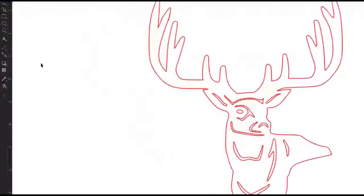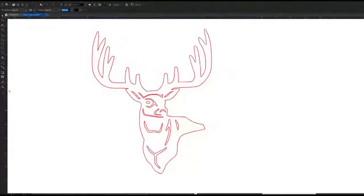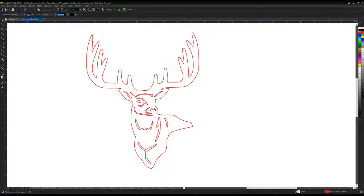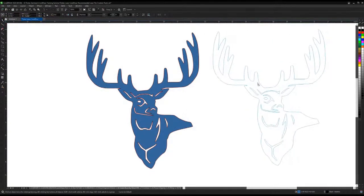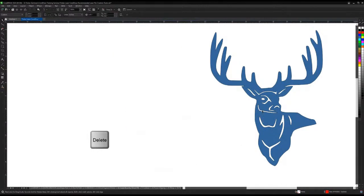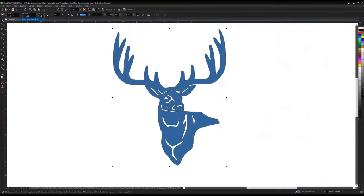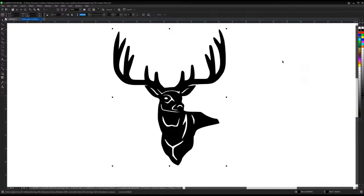Well, the Smart Fill tool with the boundary tool would do the same thing, but you'd have to fill it. Or the Smart Fill tool in this case, all I have to do is hit the tool on the left here, Smart Fill. Then when I select the center in this object, it's going to just fill up the boundary, as long as all the line segments are overlapping, they're touching, so there's no open curve. If this does not work, then the line itself has spaces or gaps between them. That creates a separate object that I can then, of course, delete the original, because there's no point in trying to fix all the little design problems. I've literally made a copy of it by filling it up, and now I can, of course, come to whatever color I want, color it in, and now this is ready to be laser engraved with a nice fill object on it.